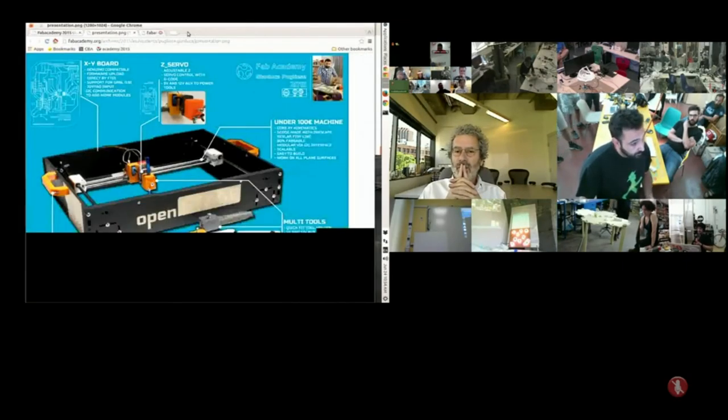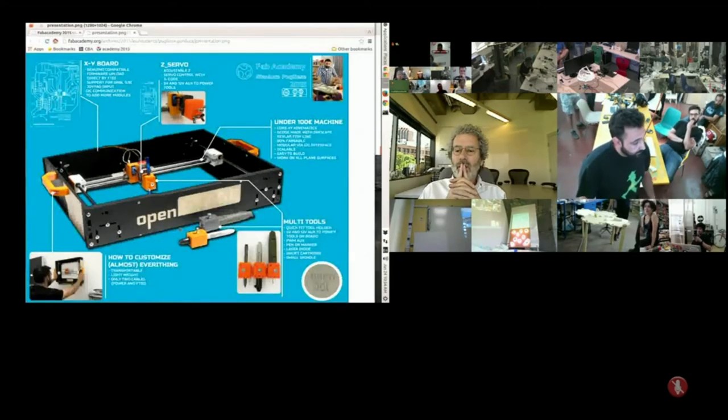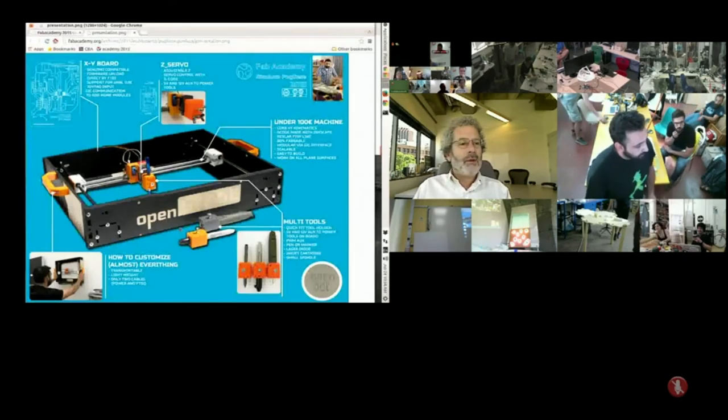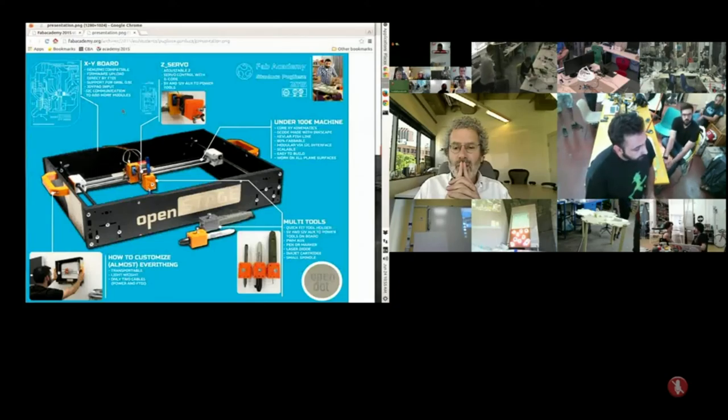I made a machine inspired by Antibot that is possible to use on any plane surface, and it's transportable and lightweight. I had some problems at the start with the fish line that I used to reduce the cost of the machine. But now I found a Kevlar fish line that is not extensible. I did many tests, and I haven't backlash.